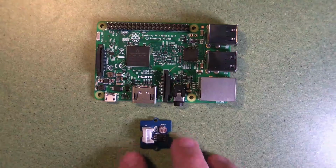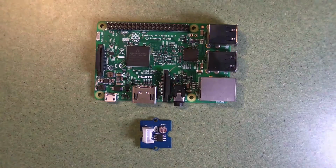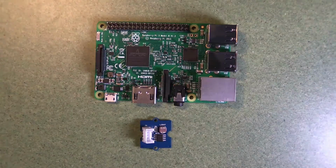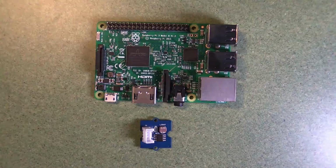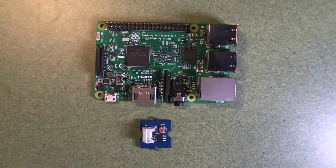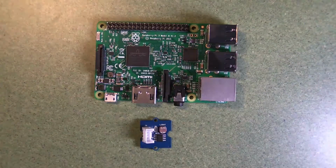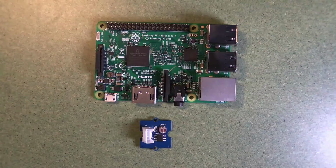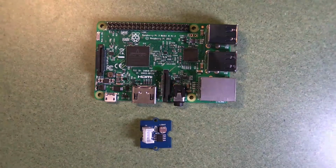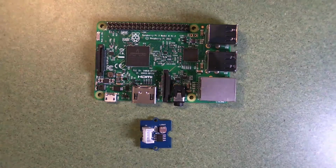You can see there, you've got a little light sensitive resistor, which measures how much light is being received at that particular component there. So that resistor will change the voltage that is being passed through this sensor here, and the device that's controlling it, like this Raspberry Pi, can measure that voltage. Except actually a Raspberry Pi can't measure voltage on its own. It needs a special analog to digital converter device to be able to measure voltage.